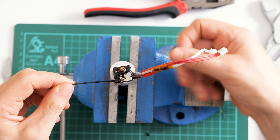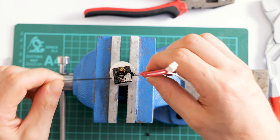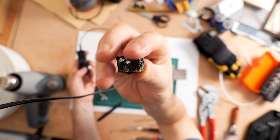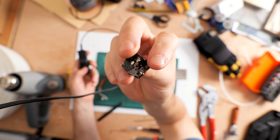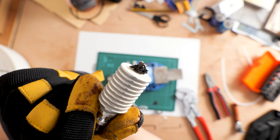I'm using a heat gun for this and I would recommend getting a cheap one from Amazon because they come in very handy. I was able to remove the cartridge and the thermistor and then the nozzle. I could then separate the heater block from the heat sink. I wanted to remove the heat break from the heat sink and I could see that the plastic had backfilled up into the thread of the heat sink. I'm heating up the plastic and using a wire brush and tweezers to get as much burnt plastic off as possible.